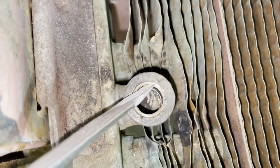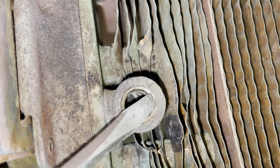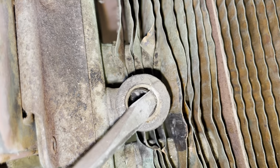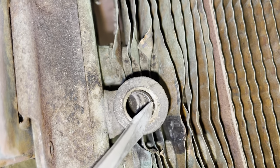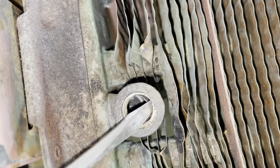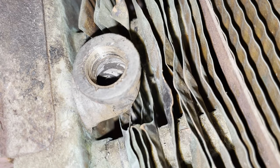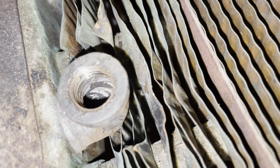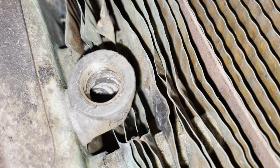The bushing that was in there, the old steel bushing, has just responded to the tap by disintegrating and removing itself. So we're gonna try and get that out. You see if the original threads are intact, they look like they are. It actually appears to be in good shape aside from one little notch right there where the light is shining.